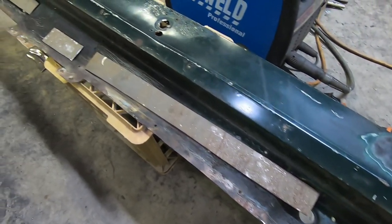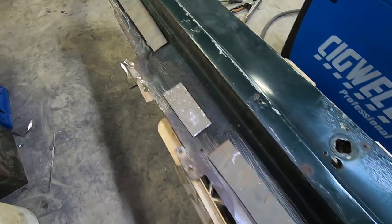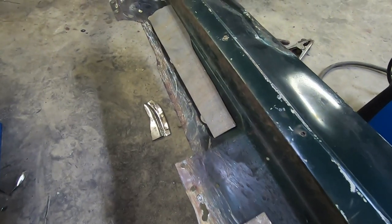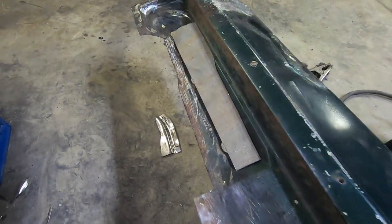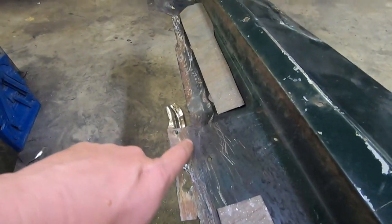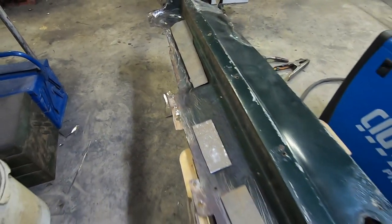We've got four pieces cut out. We're not going to worry too much about warpage with this one. They're cut a little bit longer, so we're going to just shrink them down using the stretcher shrinker and the English wheel to flatten them all out. And we'll also make sure we take care of a very minor fold that runs along this part as well. So let's bang them in.